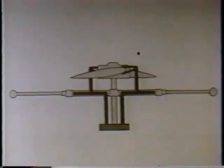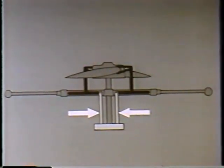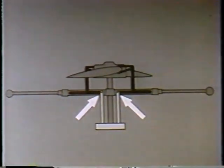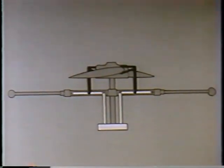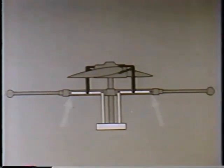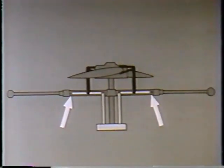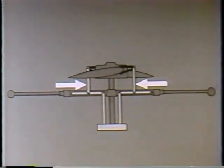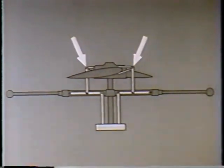This is the way it works. From the swashplate, the push-pull tubes run to the inner ends of the mixing levers, which are housed in the stabilizer bar. The other end of each lever is pivoted to the bar. Then, from the center of each mixing lever, pitch change links run to the control point of the pitch change horns, which in turn control the feathering of the main rotor blades.